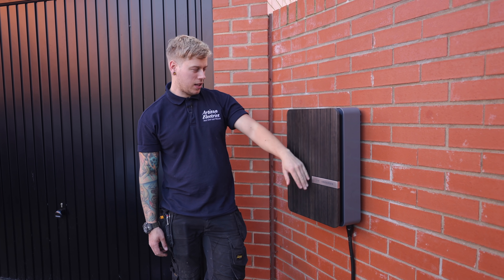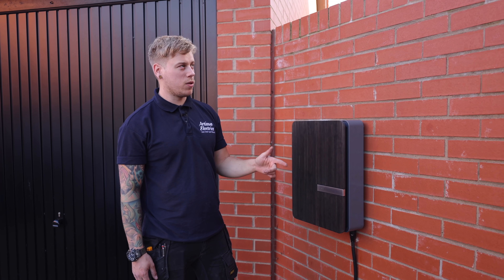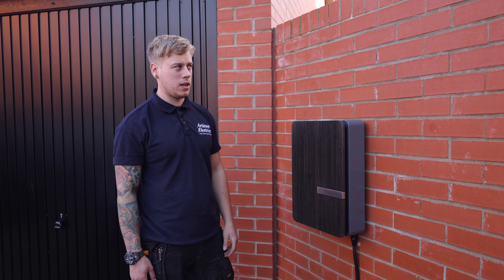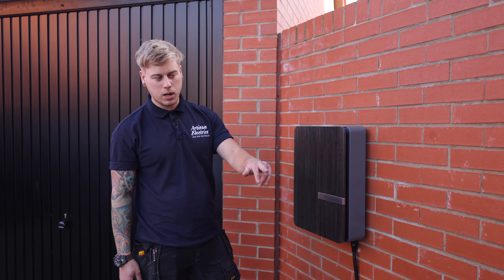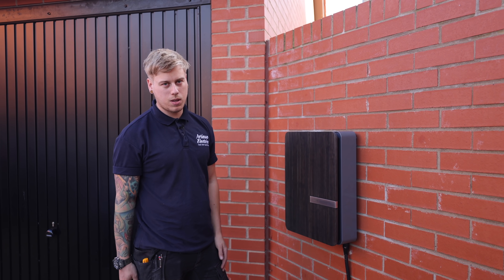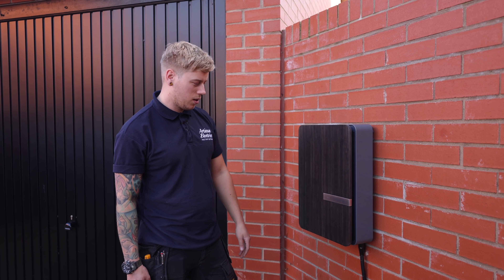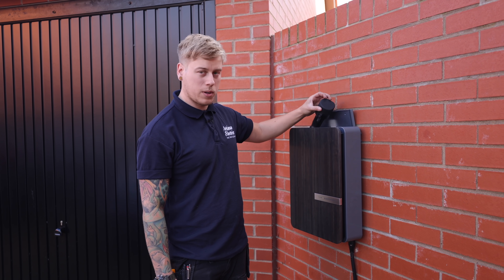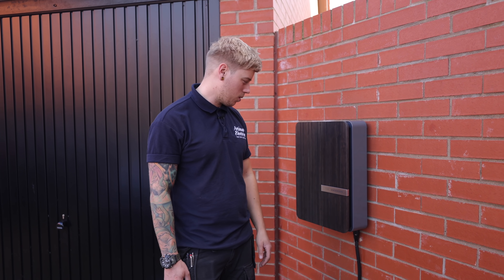Alright guys, that's it for today. Really nice Anderson — I think one of the better-looking car chargers in my opinion. We had quite a weird route today but I think it all came out pretty well. The boxing in the utility room I've left big enough for future cables, and just caulking around the edges makes a world of difference — really blends it in. Had to go a little bit under the path but we put electrical tape there and you can see it both sides so it's only about a meter, not the end of the world. I recommend these chargers — they haven't got all the features that others have, but I think they look the best and hiding the cable inside with some really nice finishes. Another interesting install, on to the next one.